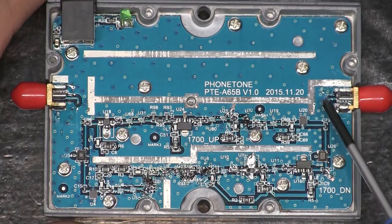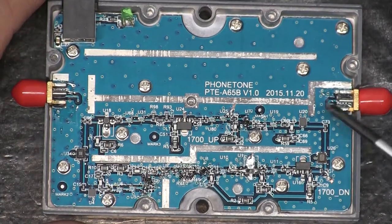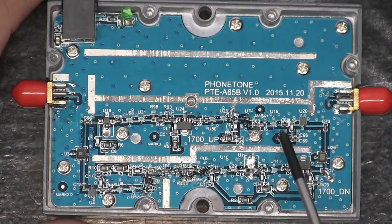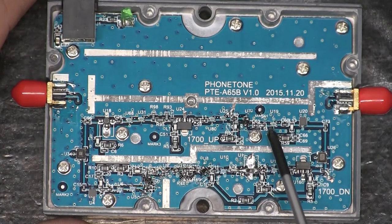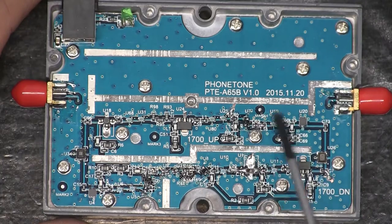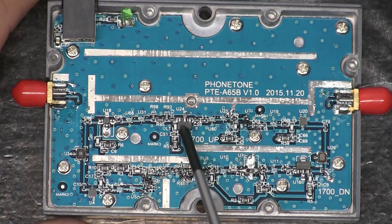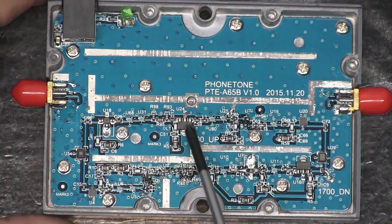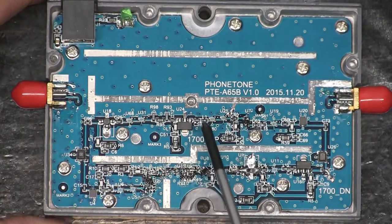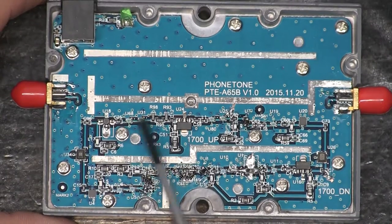Okay so what do we have here? It says right here: 1700 up, 1700 down — so it goes in this direction and comes back in this direction. On the uplink side first, there are a bunch of unlabeled ICs, but you can see what looks like an LC circuit right here. I don't know what this chip is, but these likely form some kind of a filter. This is another filter here. There's this intermediate power transistor, which probably band-passes it just to the uplink frequency of 1.755 gigahertz, and then we've got a couple more filters.